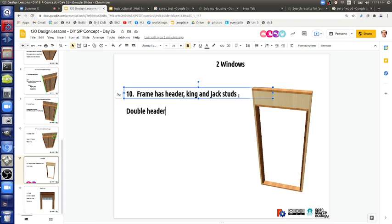Yeah. Is this not done as a module then, or rather fitted as a last piece? No, this is done as a module, and then we put the plywood on it. Okay, and the jack studs, will they come up, because you talked about measuring them when you place the header and the bottom, or will they all be made at the same time? I'm just wondering, what's the build workflow? Build step from one to the next? Yeah, because you said that the jack studs would be fitted afterwards and just measured. Yeah, yeah. So you have to have the header and this plate in there. You can't start with a jack stud.